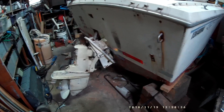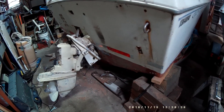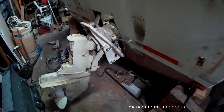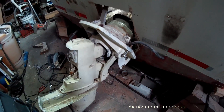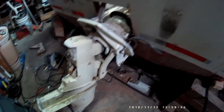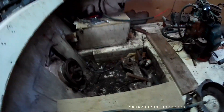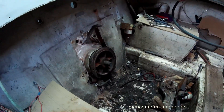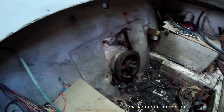You can see here now I've cleaned everything off the back of the boat and I've cut the transom a little bit, just to make it easier to get that old inboard/outboard off the back of the boat — easier than trying to get all those old steering mounting bolts off the back, as well as being able to pull the old hardware through instead of fighting to get all the old bolts out.